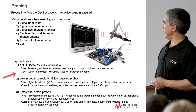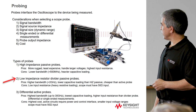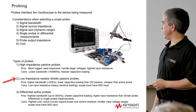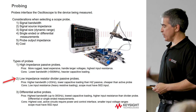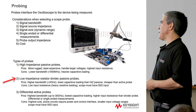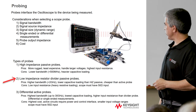The next type is the low impedance resistor divider probe. These are good to maybe 2 GHz or so, with lower capacitive loading than a high-Z probe. They're cheaper than an active probe, but have lower input resistance — the high-Z probe might be 10 megaohms, whereas this one might be a kilohm or so, limiting the impedance you can probe. Because it's a 50-ohm system, the scope needs to have a 50-ohm input. Without it, there's a big discontinuity between the cable and the 1-megaohm input that affects signal integrity, so you'd really want to drive into a 50-ohm input.